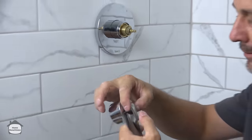what we've got here is a complete PEX system and comes down to a drop ear for the tub. You can see it right here. And what they've done is they went out and developed these little systems here. Now this is threaded 1/2 inch to go into my drop ear and 1/2 inch to go into my tub spout. All right, and it doesn't just sit in there. It can thread all the way through. It's got a lot of variability here. All right, so you can set this up with that one piece, and it should solve just about every tub situation you have.